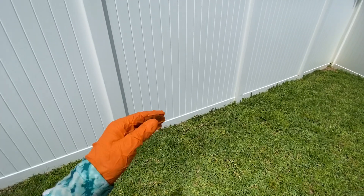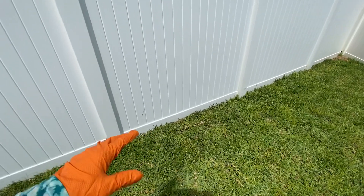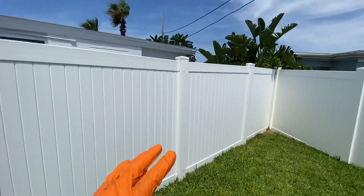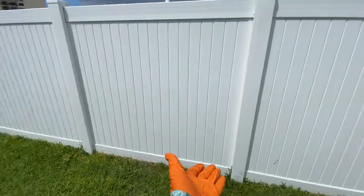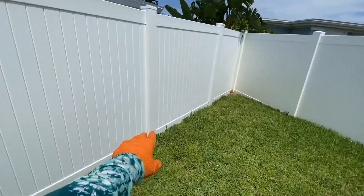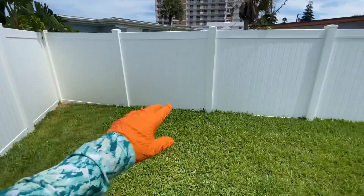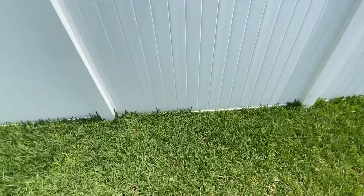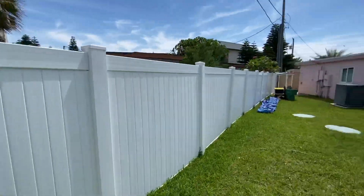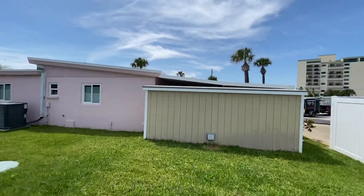Make sure to keep your grass wet, because putting down a hot mix of oxalic acid and hitting these fences with sodium hypochlorite can kill that grass. It's really important to make sure that grass is nice and wet. That way you get results like these where you don't see any burn lines and no grass has turned to straw — that's a sign you've burnt it.